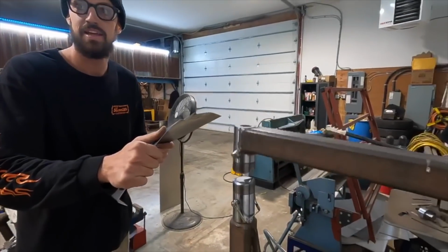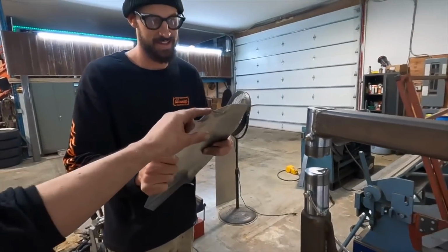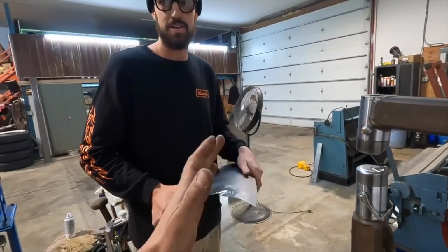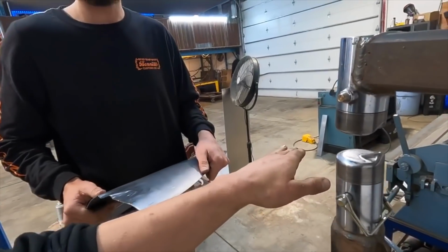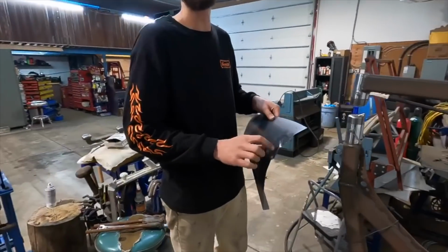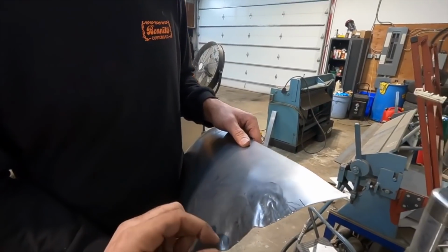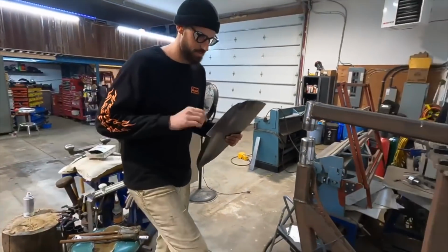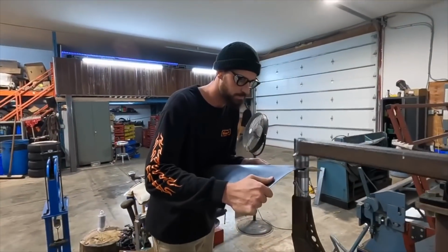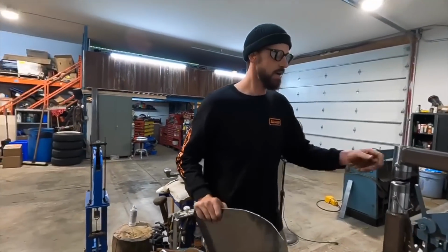You can throttle it a little more than that. If you see that it's not hammering it down, it needs more. And when you're in that deep, the hammer needs to be harder. The deeper you're in, smoother. When you're throttling it, the further your panel goes in, you're pushing down on your foot more, and then you're kind of easing off as you come off. That's a really nice one. Looking beauty. Do your little guys because you've got crinkles here, but you did go in pretty deep. Crinkle cut. Good hot chips. French fries. Beauty. That was a bit better.